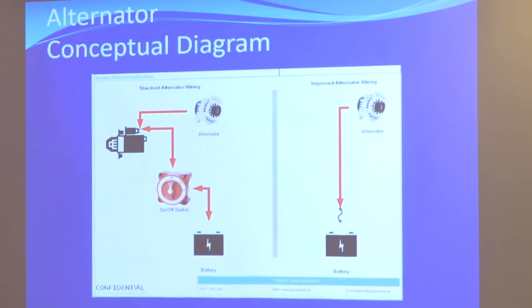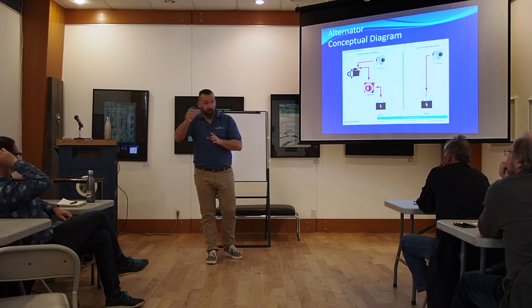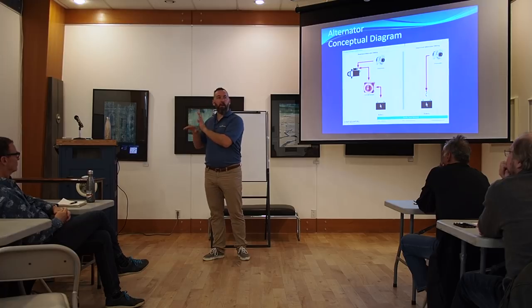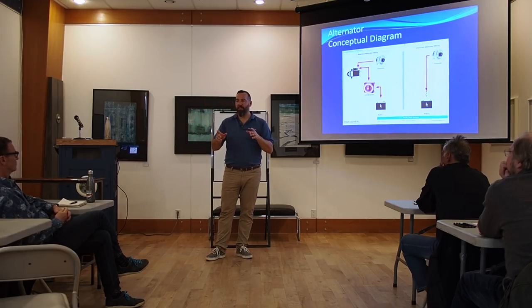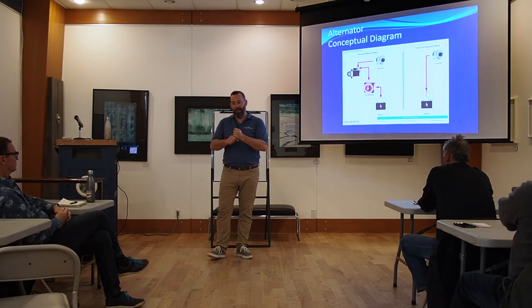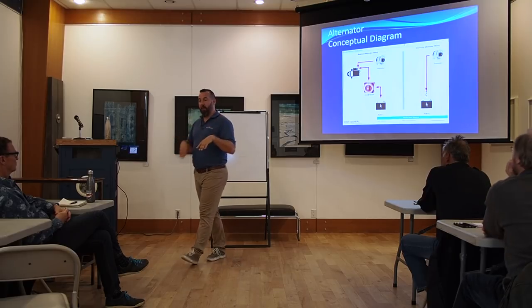I want you to think about this: your engine is completely a negative device. The whole thing is grounded — everything about it is connected to the battery on the negative side. It's the return path. It uses a path to go to ground, which is the water. A DC negative is not ground; the only way they're grounded is when the DC negative is connected to water. That becomes ground.